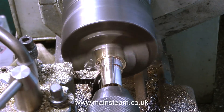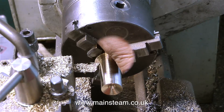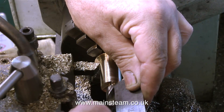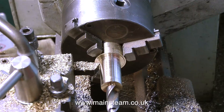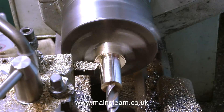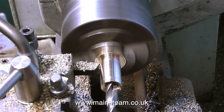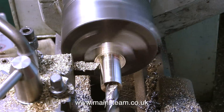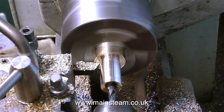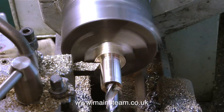The only accurate dimension is the half-inch hole going down the centre that fits over the safety valve. Whilst turning the part, I'm using a centre drill to make a centre hole in the work at this end. I need it to be heavy so that it doesn't blow off when the safety valve blows off. The next part of the operation is to drill a hole in the piece of brass, which is one inch long, using a half-inch diameter drill. Here's a top tip: when doing a job like this, instead of staring at the graduations on the quill of the tailstock, you can measure the twist drill and put a felt tip pen mark on the drill, then stop drilling when the felt tip pen mark gets level with the work. Quite simple — very non-scientific. It was quite difficult pushing the half-inch twist drill through the metal, so I changed to a quarter-inch drill bit and went all the way through with that first.